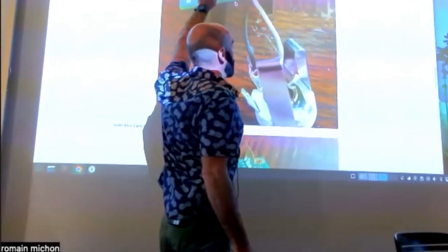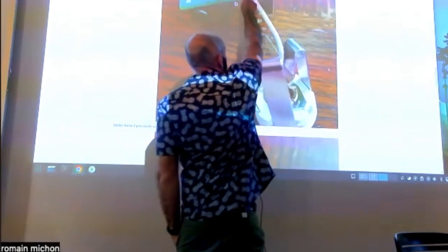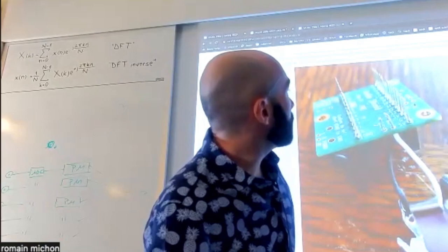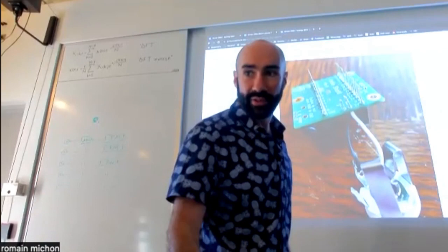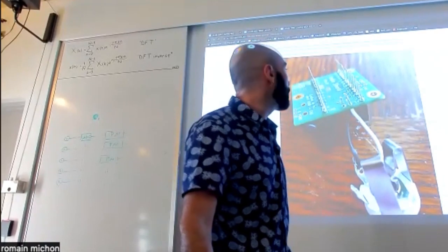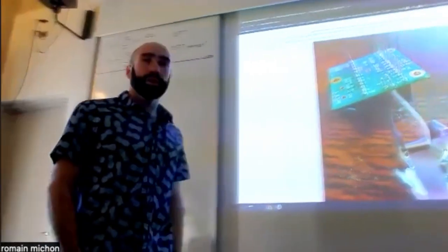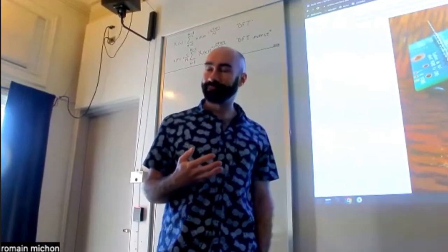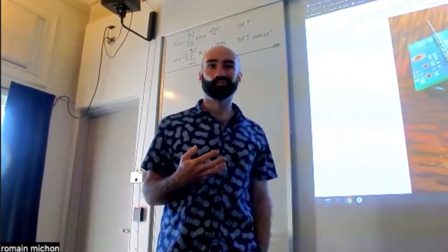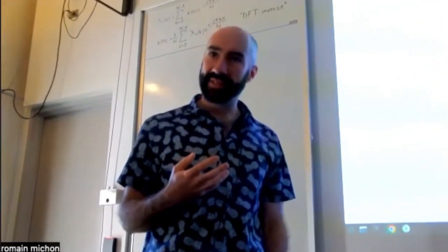Okay. The audio shield has two sets of inputs. It has a microphone input, and then it has a line input. See, the line input is here, and it's stereo, so you have two channels for the line input. For the mic input, it's mono, and you access it here. Do you know what the difference is between a microphone input and a line input? Input impedance? Yes, exactly.